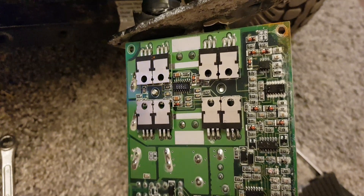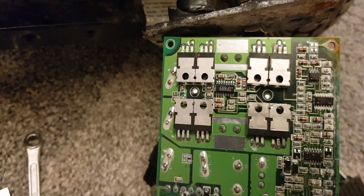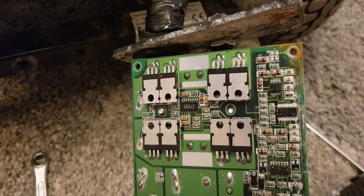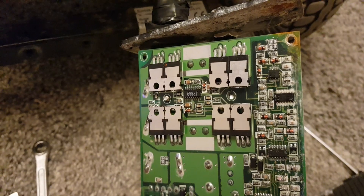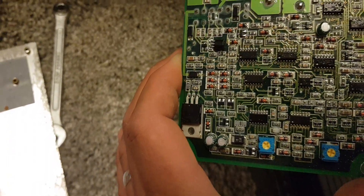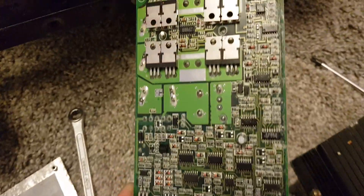It's a bit strange that they actually have a speed control on the board. Turning it over, there are your switching MOSFETs - those are what actually shunt the motor. I'm guessing half will be for forwards and half for reverse, so four for forwards and four for reverse. Those switching MOSFETs will be powering out to the motor. There are also some microprocessors and more MOSFETs down there for switching.